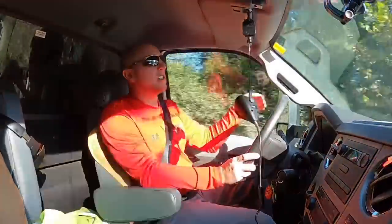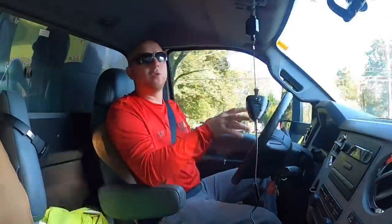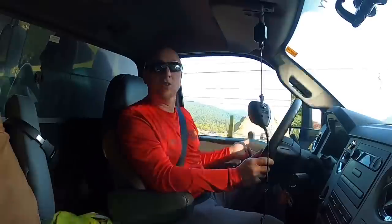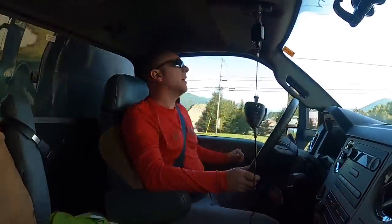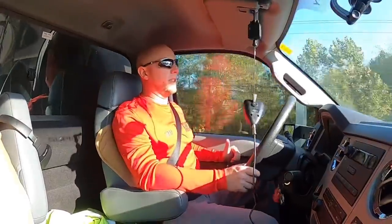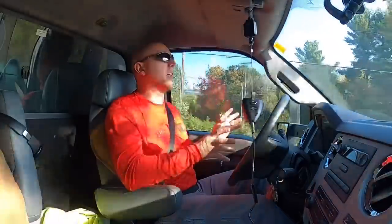And it's actually got a good slope on it, which is good because a double wall plastic pipe has a smooth interior, and when it rains heavy, they tend to wash themselves out pretty good. We're also going to set it in a little bit better than the old one, so there's no reason for sediment to start accumulating.